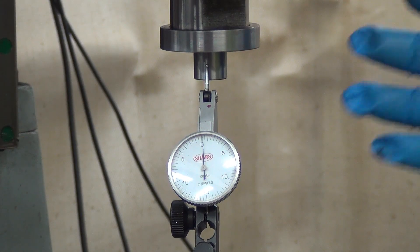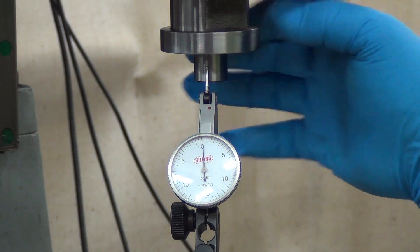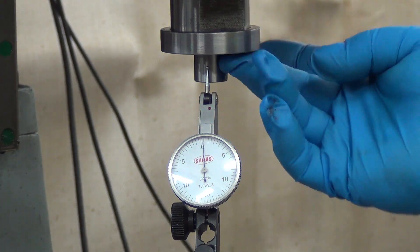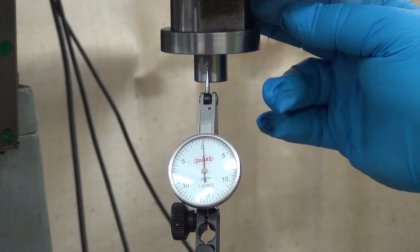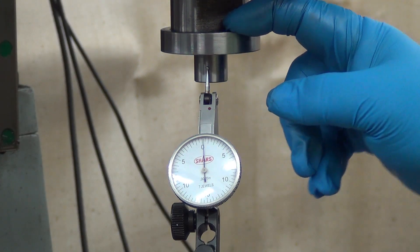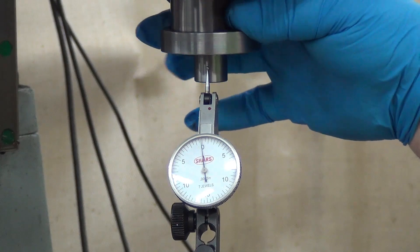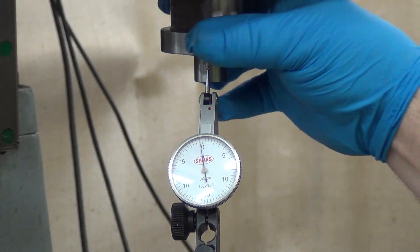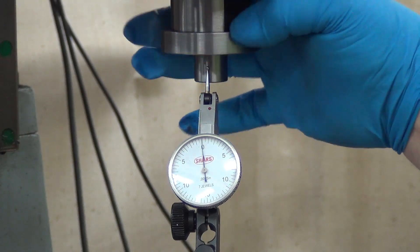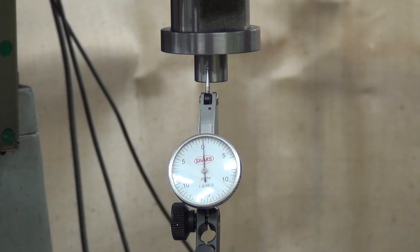This is some follow-up to the crash. I put the collar on, turned the outside and the bottom, and got just a little lip there — about 10 thousandths above the original nose of the spindle. I've got a ground rod in here with the same three-quarter inch TTS collet that was in there when it crashed. There's roughly a half thou of runout — I would have had to measure it beforehand to know if it was more accurate than that.